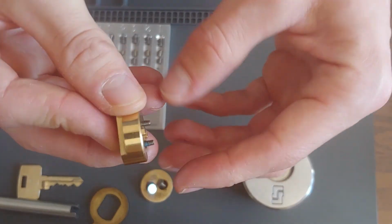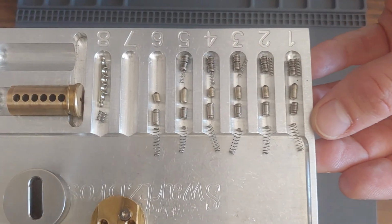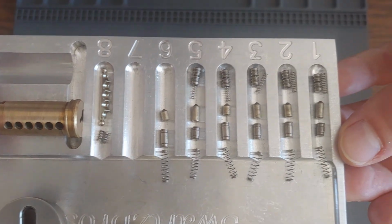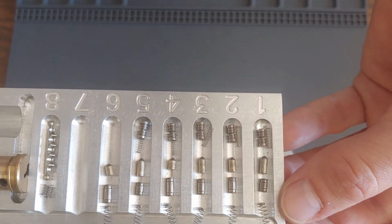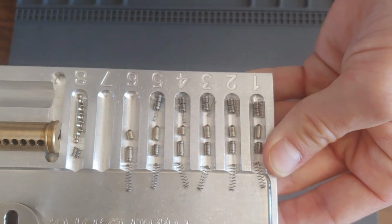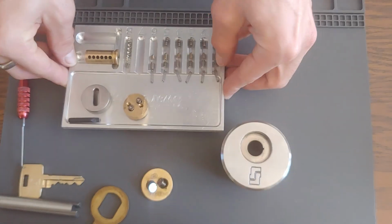The back piece, just to fit with the whole format. And let's get a close up of these parts. So we have six barrel spool drivers with the matching counter milling for the plug. You then have the five side pins with those nasty false gates. And this one acted a little bit like tapered pins. You really had to wiggle a bit of tension and keep tapping under them repeatedly with your pick, boop, boop, boop, for them to set progressively but slowly and surely. And that's what got the open.